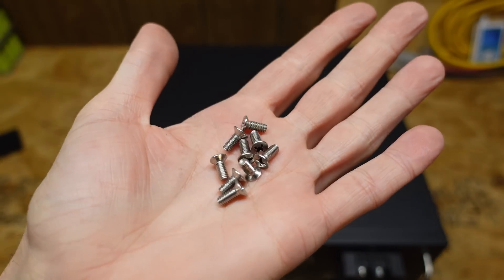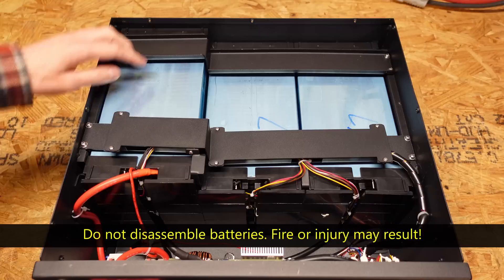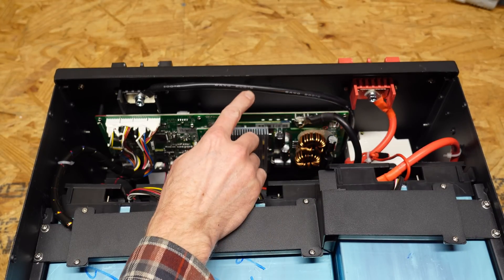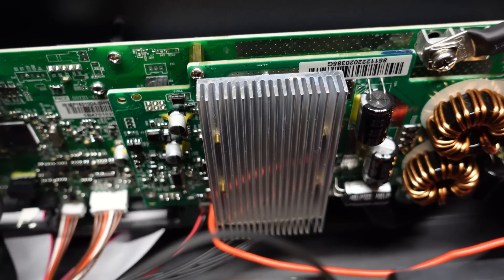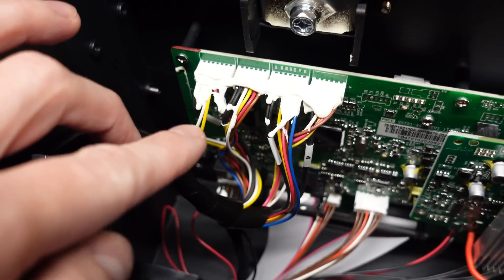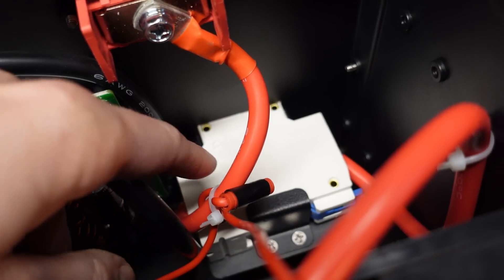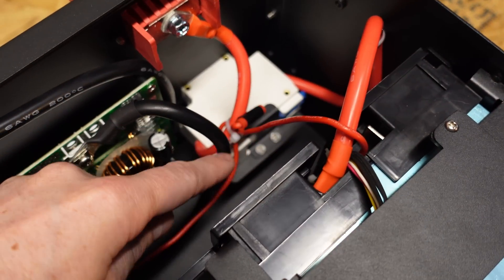To open this battery up, there are nine Phillips screws lining the perimeter of the lid. Quick glance inside — we see three rows of cells, 16 cells total. This is a 16S battery. Looking from the back, our main cabling is six gauge silicone insulated wire with a 200 degree Celsius insulation rating, which is very standard on most of these batteries. We can see some inductors on the right and a large heat sink. On the right-hand side there are cables for communications ports and the upper cables are for temperature sensors and balance leads. The main positive comes out of the battery pack and goes straight down to the circuit breaker. We've got one positive lead up to the terminal and a separate number 16 silicone insulated wire coming off the battery pack going over to the BMS — I'm guessing that's power for the BMS itself.